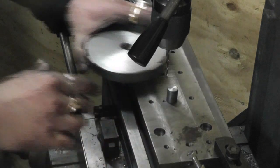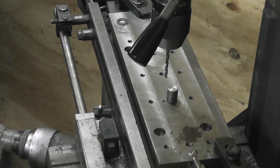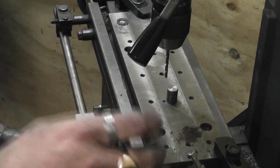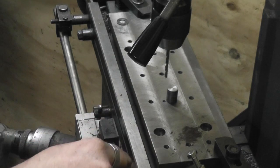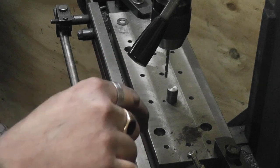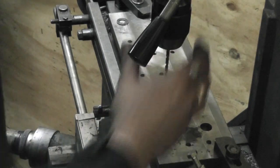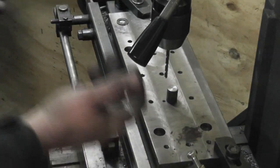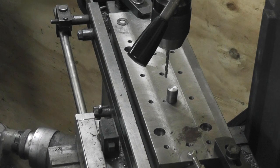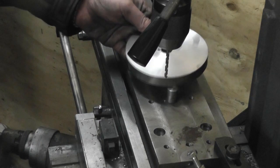When you tap down you'll see the end of the drill bit shift, so you just rotate it — don't touch the table handwheels as you do that, it'll send the jig out of alignment. If you go the taper pin method, obviously you don't have to do this, but then you have to mess around with taper reamers and getting the depth of the tapered hole perfect. Because when you put a taper pin in, if it's not absolutely perfect it'll either drop down further in or stand further out and you won't get them all aligned up perfectly — and I've never used a taper pin before, so I can't advise you on that.